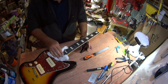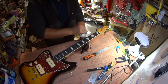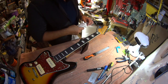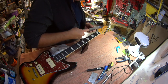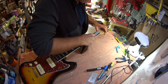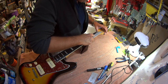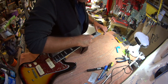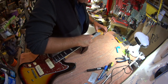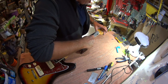What I'm going to do now is brush off the bulk of the dust, if I can. I won't clean this off just yet, but I'm going to file back the nut. When you're doing this, you have to be extremely careful not to end up hitting your frets anywhere along the way. So don't attempt this if you're not confident you're controlling the file adequately,